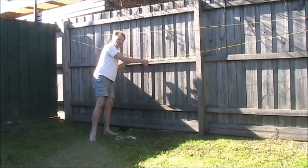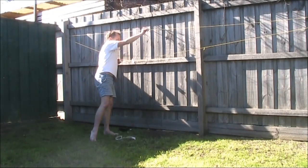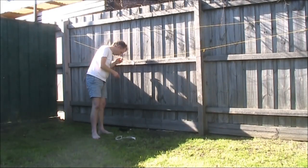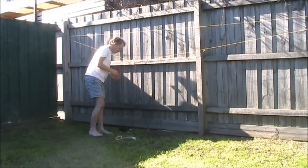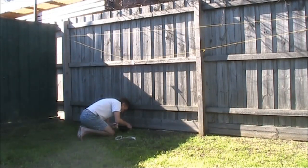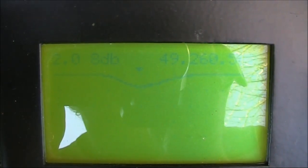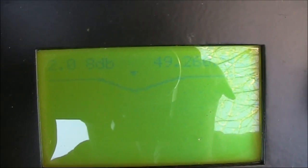Just for fun, we'll keep moving this and see what other interesting frequencies we can get. Looking at 25 megahertz, we're now back up to about 1.2-to-1. Checking 50 megahertz, it's a very flat curve, hardly a dip at all — around 2-to-1 at about 49.2 megahertz.